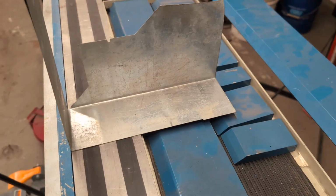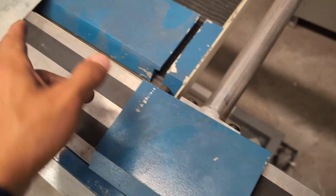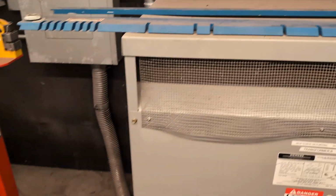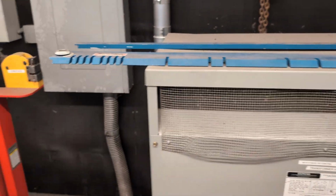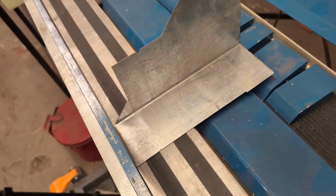Just like that. Let's say you had 2 sides on here, so you had 1, 2, you could either put fingers inside of there and then remove them afterwards. And then an alternative that works sometimes is to use that longer finger with slots at various intervals. So that gives you maximum clamping power, but also slots for the sides of your pan to come up into.